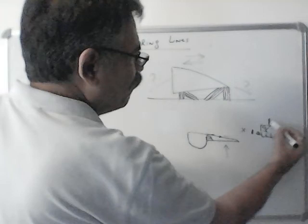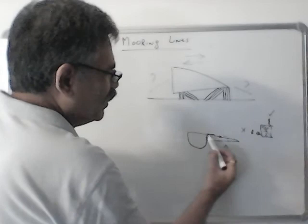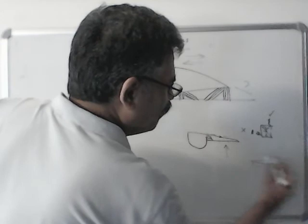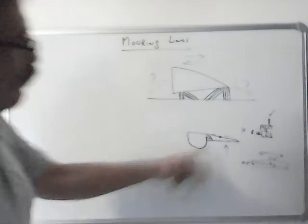But if you have a breast line with a better angle — as you can see, this can also be split into a horizontal component and a vertical component. If I complete the rectangle and this force is 2 tons, I will get about 1.5 tons of horizontal pull and maybe just 0.5 tons vertical. So we normally don't get breast lines with a good angle like this — we get it close to the ship, which is not helping much. And therefore we use head ropes.